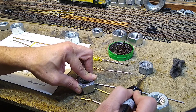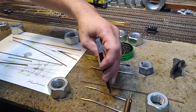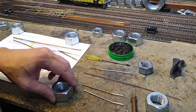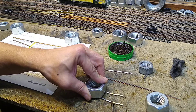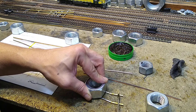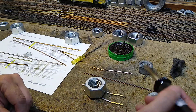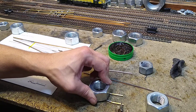I bet it's going to work just great. I like the fact that it doesn't take so much heat, because sometimes with 100-watt irons you really got to heat it up. I've used a big 250 watt and an 80 watt chisel tip before. I want to use something that melts at a little lower temperature. When joining these two rails, it's going to grab underneath much faster. If you heat the rail too much you can damage the PC board tie — it can start to peel up, and we do not want that.